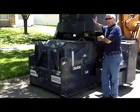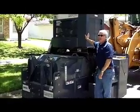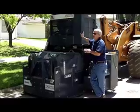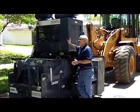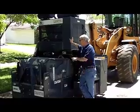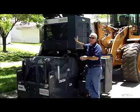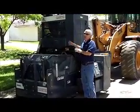It drives a hydraulic clutch into a set of belts that are coupled to a planetary gear set inside the drum. So we're stepping down the engine speed from about 2400 RPM to about 105. And all milling machines run in that 105, 120 RPM range. So that's our range with that. This particular unit has a 40 inch wide drum. We do go up to 72 inches in width and up to 200 horsepower.